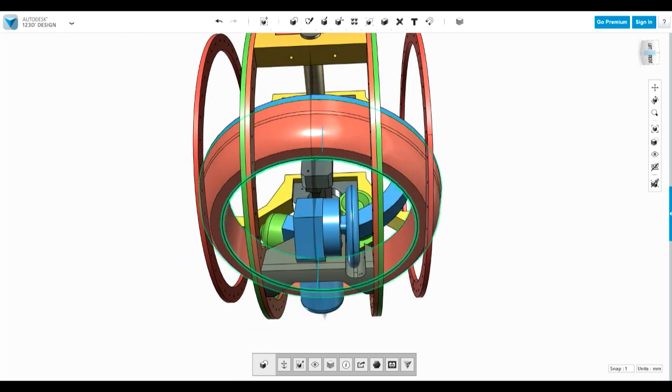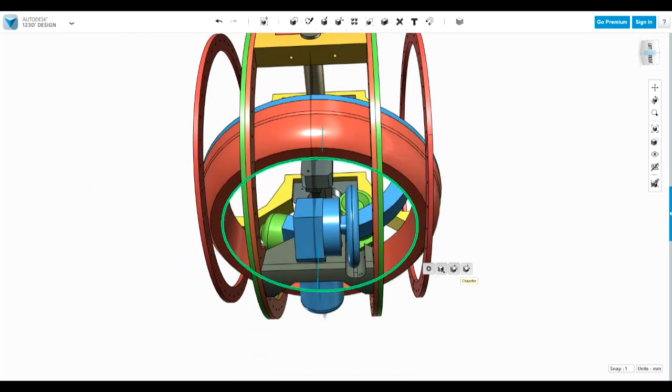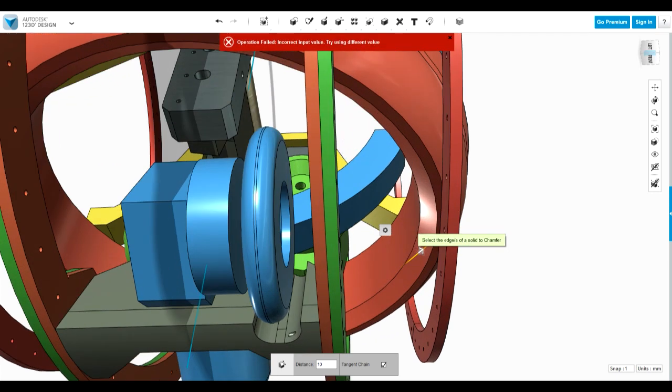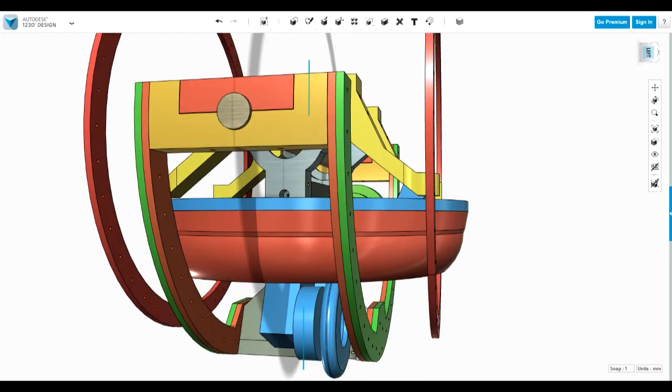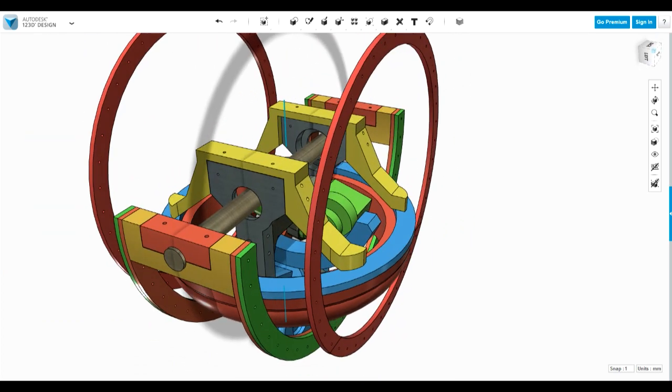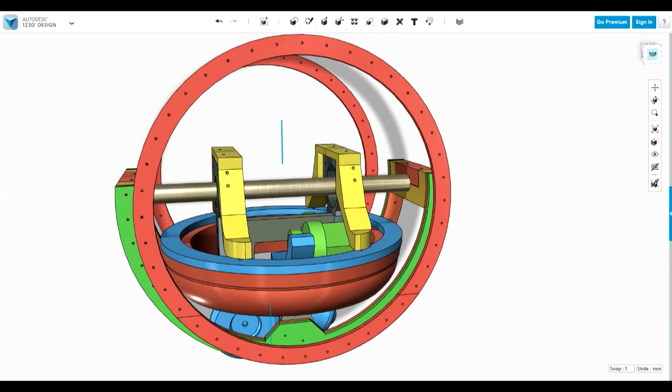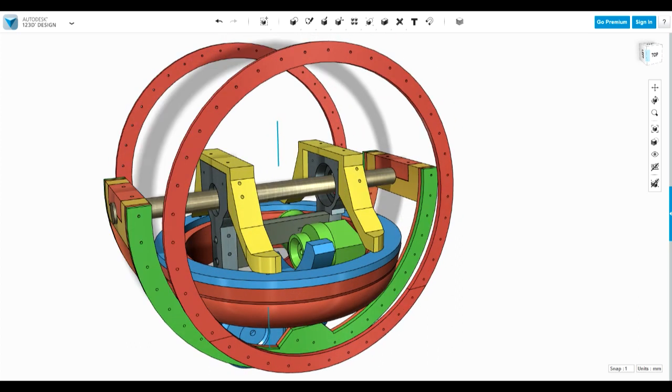And I can still trim off a bit of the inside there if I want to, so that we can give that a slightly bigger travel. But we'll see how that goes when we come to print the flywheel. And the flywheel is going to be sort of empty, but with screw holes to screw the Lazy Susan into, then it's going to be filled with lead. So we'll print these and mount it up and see how it looks.